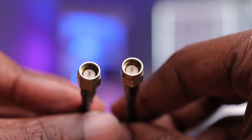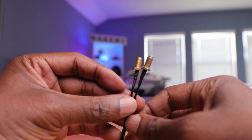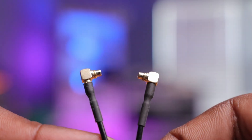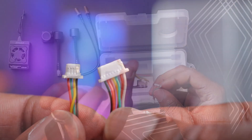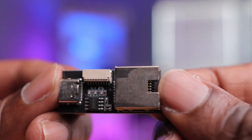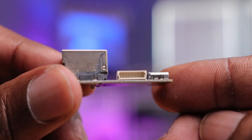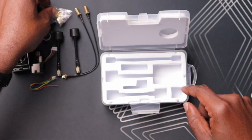This has a lot of accessories for this VTX. Looks like two antennas with SMA connectors. There's also an adapter — looks like an MMCX connector to SMA, so obviously the connection on the VTX is MMCX and we have to convert that. We have connectors to go from the VTX to your flight controller. There's also a cable for updating the actual VTX, along with what looks like a network board that converts from Ethernet to the special update cable. Last but not least, a bag with mounting screws, nuts, and washers to mount the VTX to your drone.